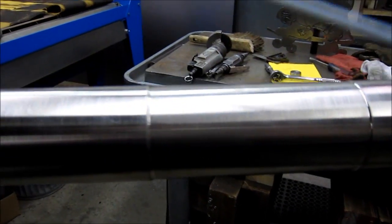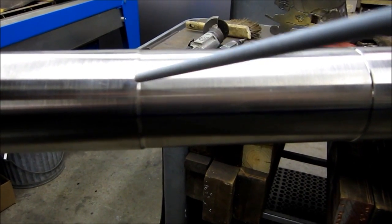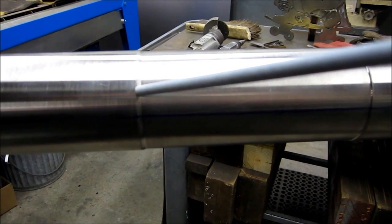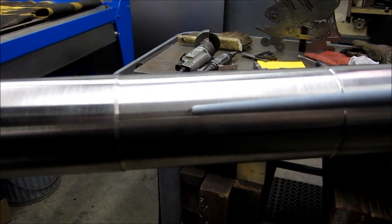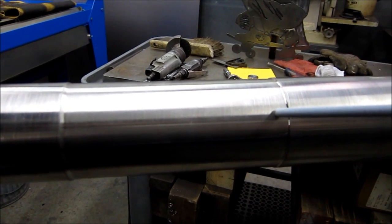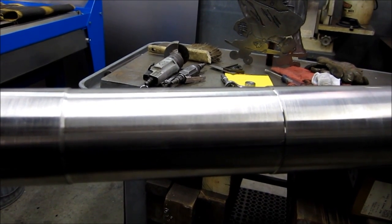Now here's the cutaway here. All right, and I come in and I start an arc, and I usually start it inside my section right here, ignite it, come over here, pause against that side right there, and then slowly just hold a close arc along here. When I get to this side over here, I just pause right there and then roll back in about that diamond right there and lift away.